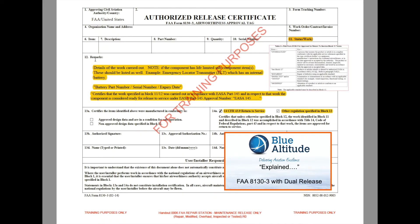Turning attention to Block 12, the remarks column — I've highlighted it here with an example of what you may find. It should include detail of the work carried out. Importantly, if the component has a sub-life-limited item that is time-dependent, that should also be stipulated. For example, an overall assembly may include an internal battery with a part number, serial number, and expiry date — when that battery expires the item needs to be replaced, so that ongoing life tracking should be specified in that field as well.